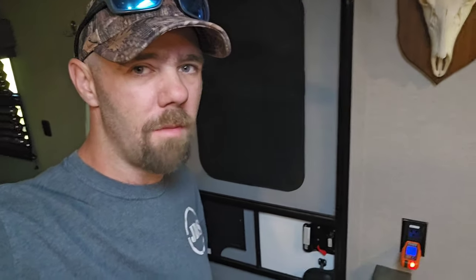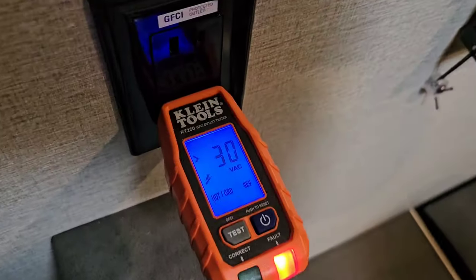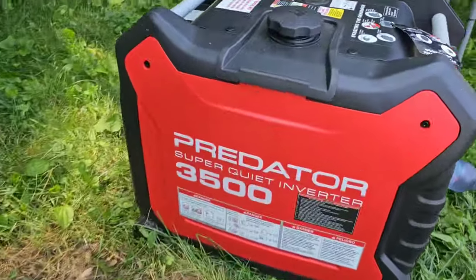The power of the internet is absolutely amazing. Over 1.5 million people at the time of this filming have seen the video pertaining to that little tester there on my camper wall — yes, that's taxidermy in my camper. What that video was talking about is how this outlet here has 30 volts with hot ground reverse, and it only happens when it's hooked up to this generator. Running off shore power, solar power, or even the 9500 watt Predator inverter generator, it doesn't do it. It only does it on this 3500. Now I know the answer.